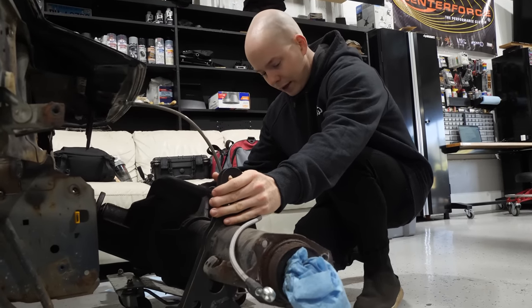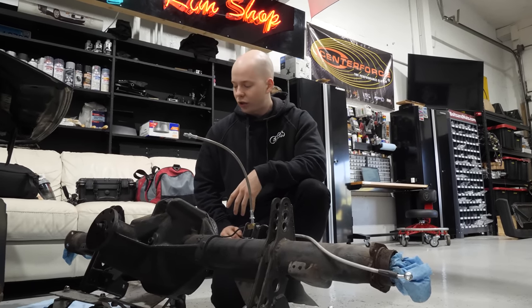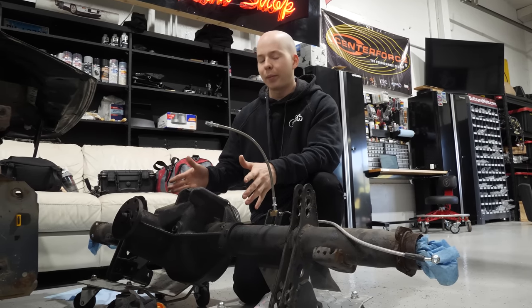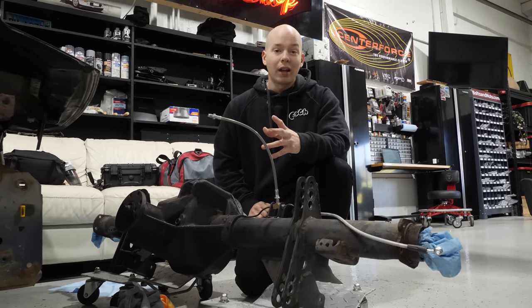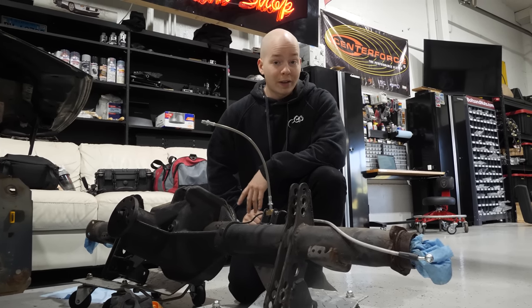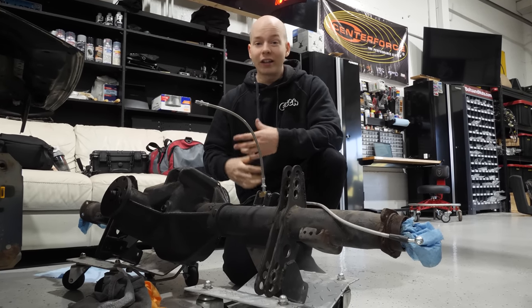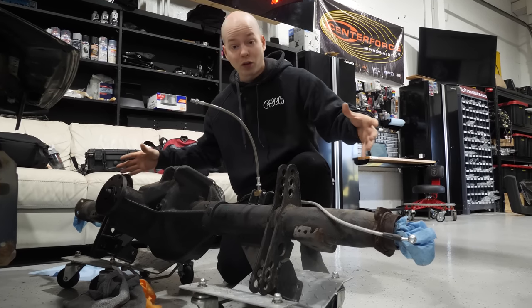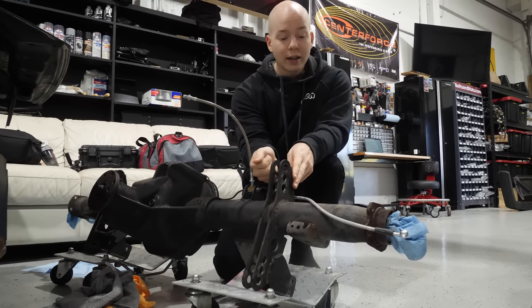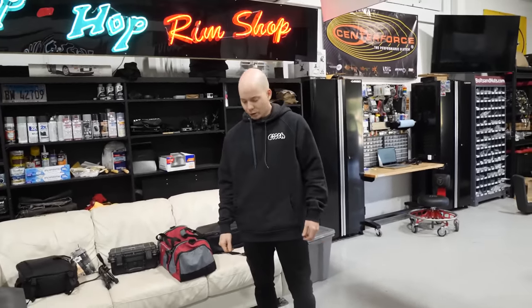We do have to modify the solid axle a bit. This is a solid axle out of a Ford Explorer. It's an 8.8 inch. Now, the ones out of the Ford Explorer did not have the pumpkin in the middle. This side is 3 inches longer than this side. Not a huge deal. But when I'm trying to cram a bunch of stuff into a small amount of space, having the pumpkin not in the middle and having the drive shaft go through the entire truck at an angle, it takes up more space. So we're gonna shorten this side of the axle 3 inches to make it symmetrical, get this thing right in the middle. Then we're gonna remake these brackets, actually cut off the leaf spring mounts that have been on there forever, then throw it in. Of course, in order to work with this, we gotta get rid of all the gear oil in it.